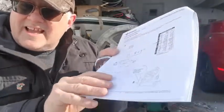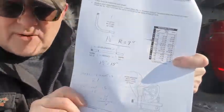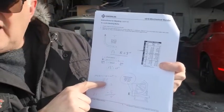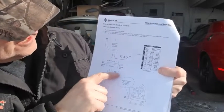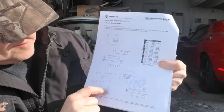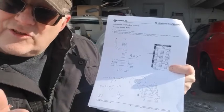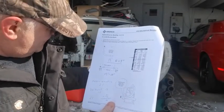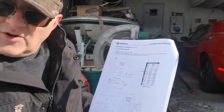Now let's go get some measurements and figure out how to bend a piece of pipe. You can get your instructions online. We know we want a 21-inch hook on this. We know that the deduct is 15 — we looked it up on the chart. 21 minus 15 is 6. So we're going to mark our pipe 6 inches from the end, not counting the threaded zone. Then that goes right on here — we'll turn this up and put it in there.